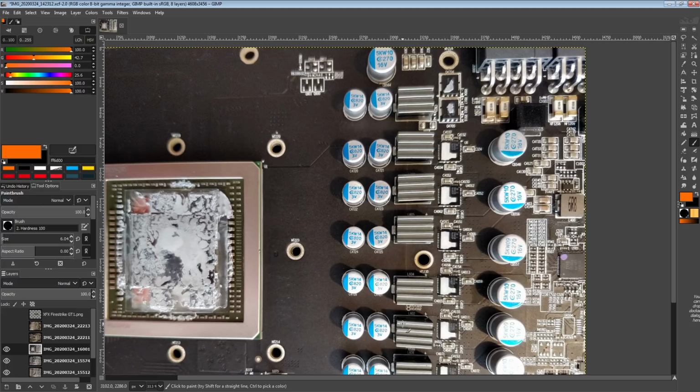Or well, it's not even about massive overclocks. It's basically like if you had a core that on an inferior PCB does, say, 1100 megahertz, then on a superior PCB with a better capacitor configuration it does more. And it's not just more, though in a lot of ways more does help: the more capacitors you put in parallel, the lower your ESR is. So in a lot of ways, more a lot of the time just works.